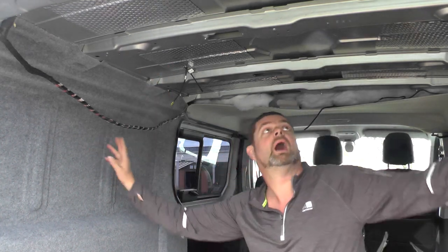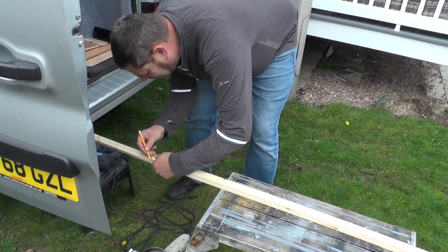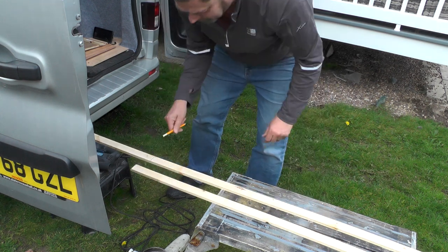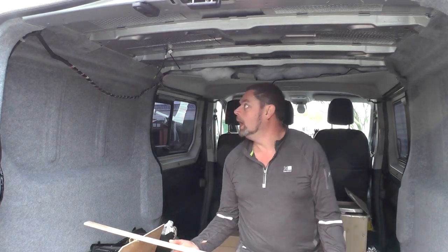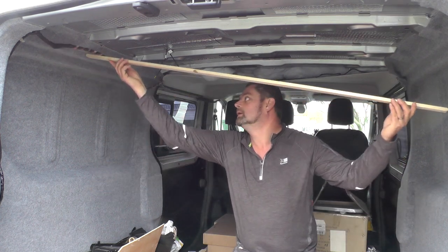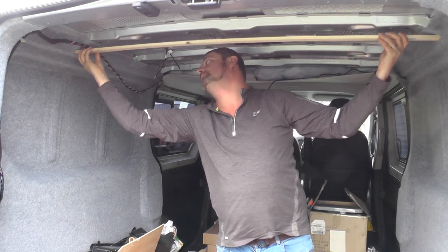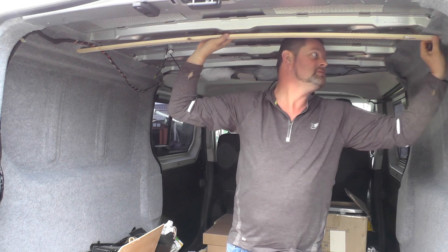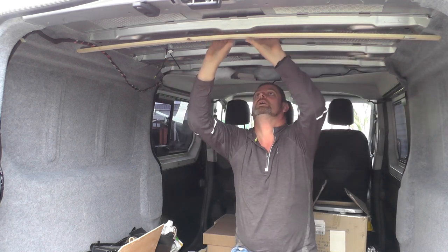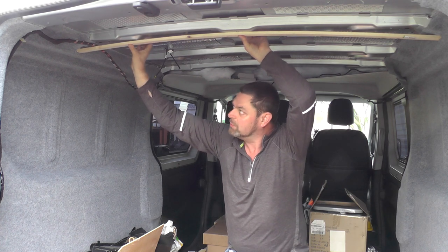I'll get this first one measured up and in position so we can see where we are with it. Put this piece off, measured it up — it's bang on and fits just tight. So I've marked it off so I've got my next cut in the right place. I rounded the edges off a little touch there as well and now I'll push that into position. There we go, that's a nice tight fit. It actually stays up under its own tension. I'll put a screw there, one there, one there — which will pull it up tight and make it properly rigid.